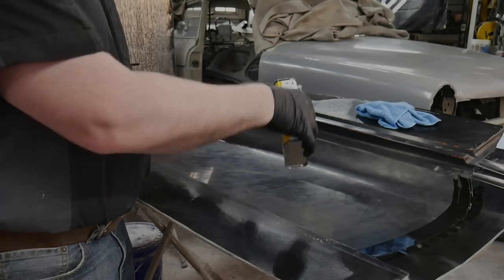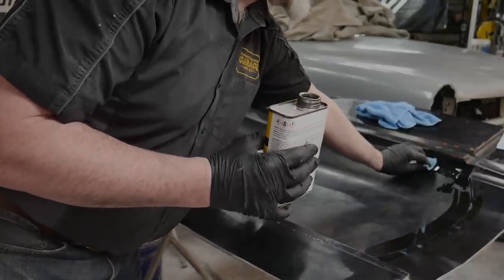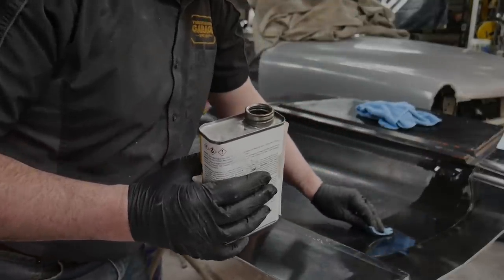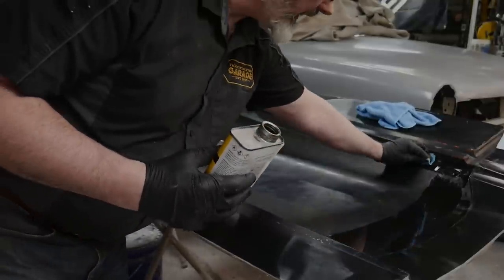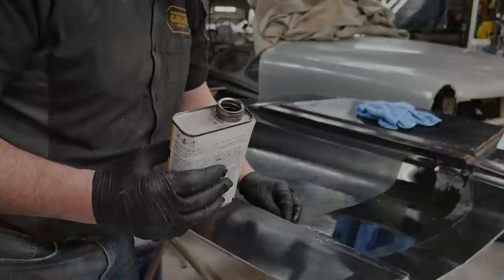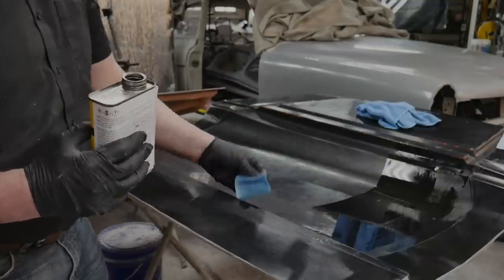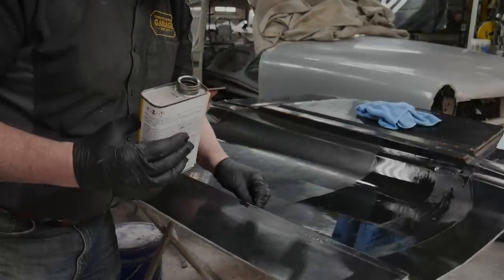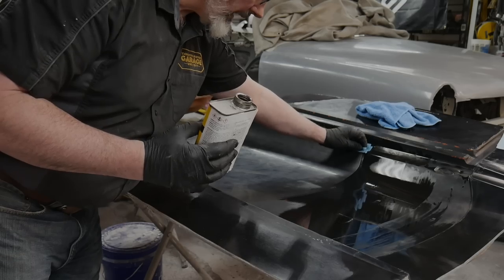Very carefully wet it out. In some detail areas you can spend a little time, and in parts of the mold you can't always follow the perfect application schedule. What we're trying to do with the different directions is avoid areas where the product isn't actually being applied — there can be small scratches on the mold surface and you want to make sure all of them have been coated. I'm just very carefully always moving in the same direction applying it until it's fully wet.